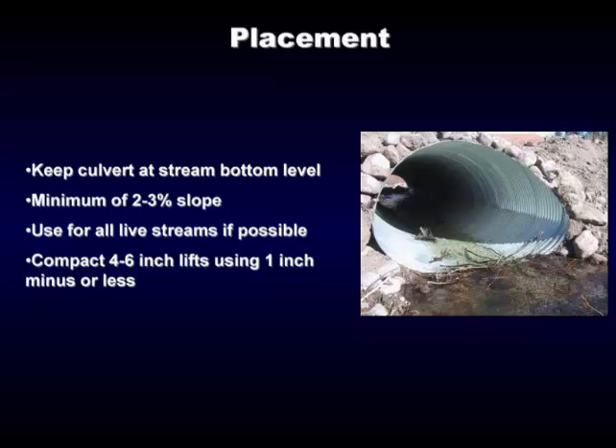Get down under there and take a crowbar or shovel even though you've filled it up both sides — do it in four-inch lifts. I've got a 24-inch culvert I put in with an excavator real quick: we dug down, took that water where the beaver dam was and pushed it all through that 24-inch. This amount of water goes through a 24-inch right here. Rather than dig it back out when we were through, we left it, which is a good idea if you can do it. It is a mess trying to put big culverts in while the water is running, though sometimes you have to.